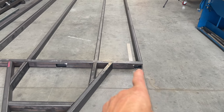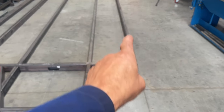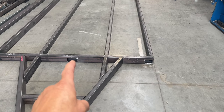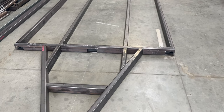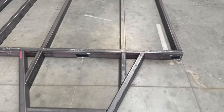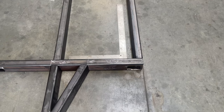We also put all of our plumbing inside the chassis, hence the holes we've put in that front crossmember. Those holes go through the front crossmember and the back of it, so you can run your plumbing and wiring all down the chassis. The front tank that goes here has to get all its pipes and wiring into that crossmember. Once we've cut it and cut all the various holes, we lay it out on the ground.